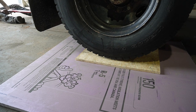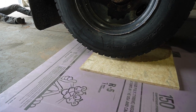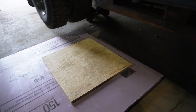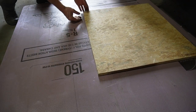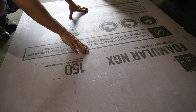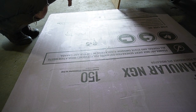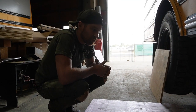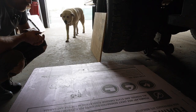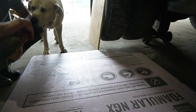We use the 150 for insulation in our doors. Let's bring the camera over and pull that piece of ply off and see what we got. It looks fine. Can you feel anything? A little bit right there. So pretty awesome. 15 psi doesn't feel like much, but with a distributed load like that it's not going to crush. This really all comes down to the subfloor material you're using, because that's what's going to distribute the load. Point loading — I mean, I can stick my finger in and make a little dent — but awesome.